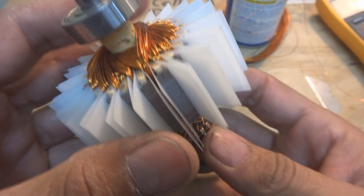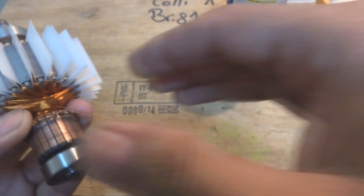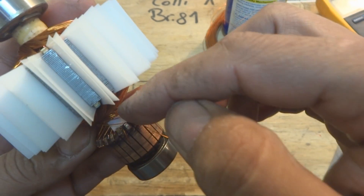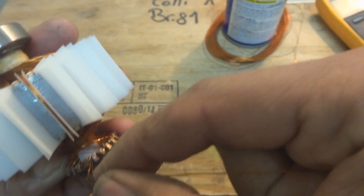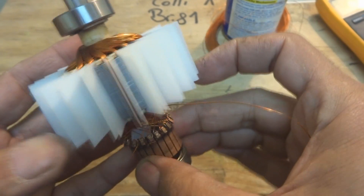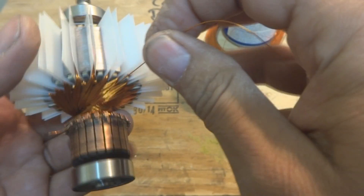Now is the ending of this job. As you can see, here is what I just scraped. This will go to the commutator segment. Just complete this coil and then later on we will start the final coil. Here it will go — as you can see, I also put a paper underneath. This will prevent it from short-circuiting to the starting end of the coil. It's better — sometimes we put it if we have doubt about short-circuiting.